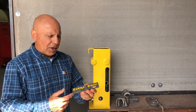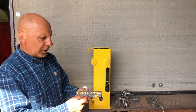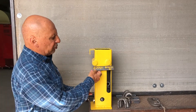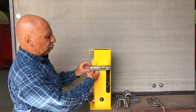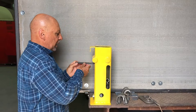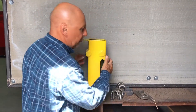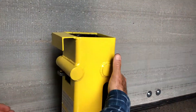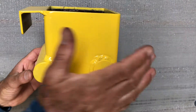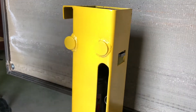It should be six inches long approximately, three-eighths thick, and you're going to want to pay attention to the centerline of your specimen so that when you put it in the jig, it is centered on the two shoulders. I'm going to place a sample specimen in the jig. I'm going to slide it through until it's flush with the right side of the jig. If you have a six-inch long specimen, it should be flush with the outside of the jig, and we can place it up against the back side, which will locate it in place nice and straight.